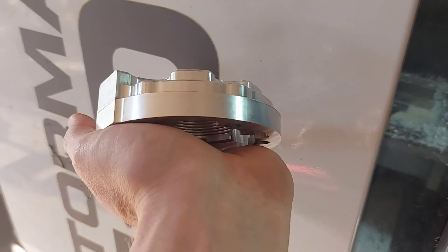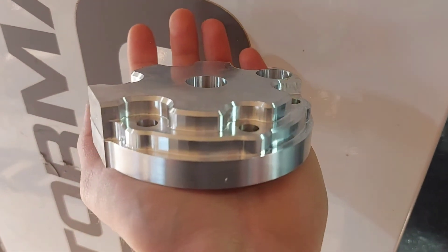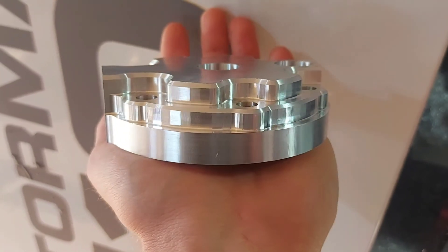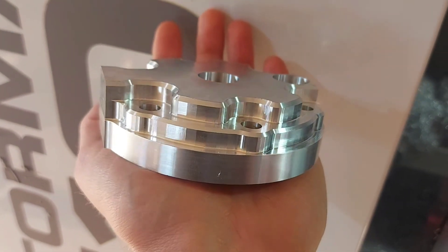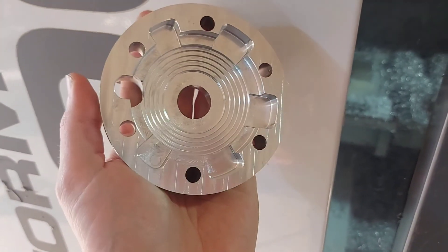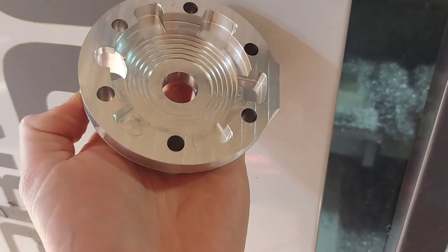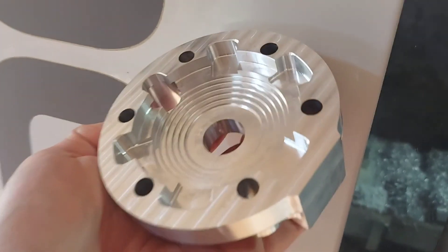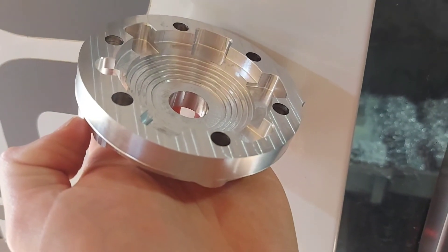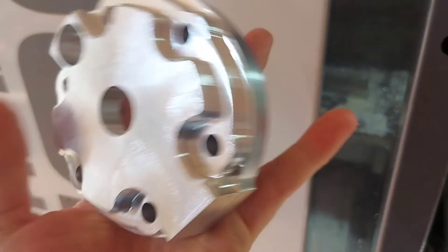I did a finishing pass on the biggest portion of the diameter on the bottom, but I left the interpolations up top because I feel like it gives it a cool look — I know some people may think it looks cheap, but I kind of like it. Let me know what you think in the comments; I can always change it later. My bore holes came out exactly how I programmed them — I had a problem before where they were always undersized, but it came out good this time. I left this step for now; later when I'm running production I'll use a ball to smooth out that slope, but for testing purposes we'll run with this. Let's get started with the combustion chamber.